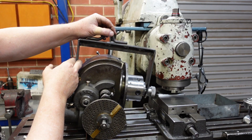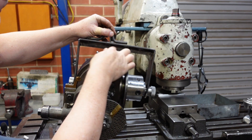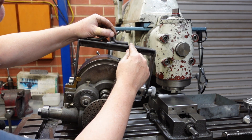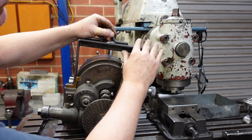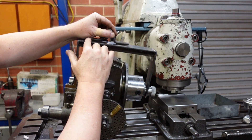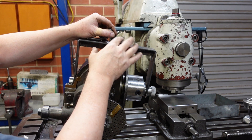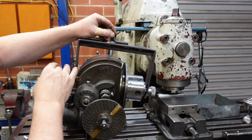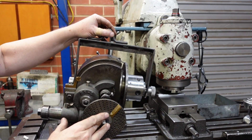That lifting loop is going to pull up here, and that's why I've got this reinforcing piece underneath — without it, it might tend to bend or move there. By having that reinforcement I've stiffened it up so this is, fingers crossed, a rigid beam. We'll just pick up from here and here, with a strap over the side.